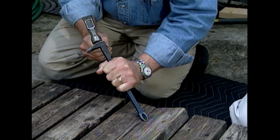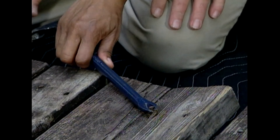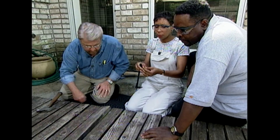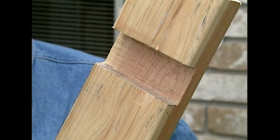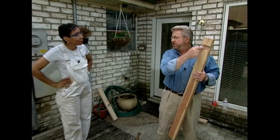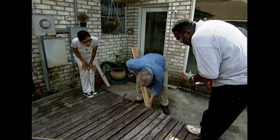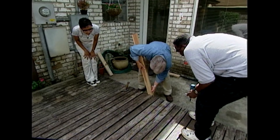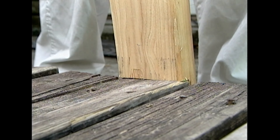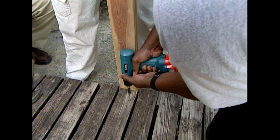Our first step is to fix those twisted planks. We begin by removing the old nails — I drive the prongs of a nail puller beneath the heads, and then Andretta prizes them out with the other end. Next we'll try to straighten out those boards using my high-tech deck board straightening tool — a two-by-four with a notch cut out of it. It slips right over the end of the twisted board and levers it straight. Kenneth then reattaches the problem plank with five-inch screws, which create a stronger grip than nails.